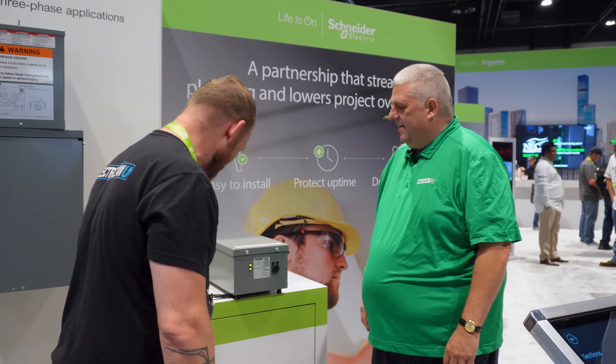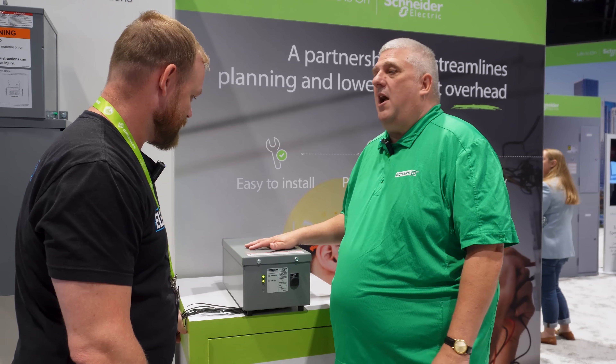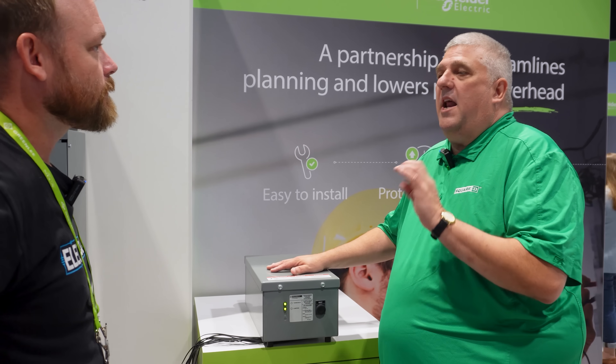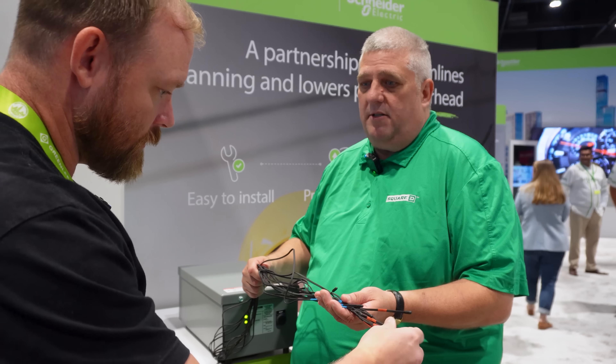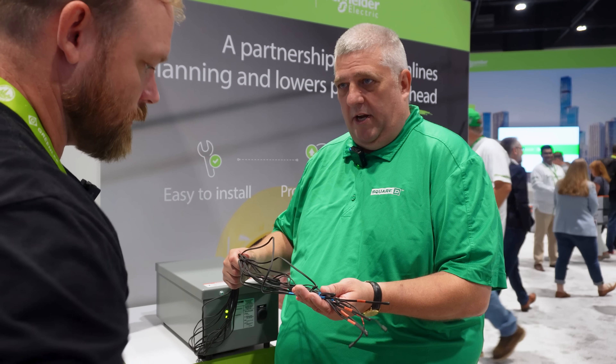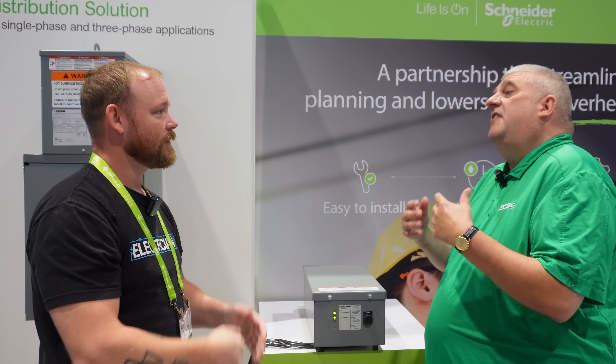What is this with all these crazy sensors and leads? This is a factory option from Schneider Electric — it monitors your connection points inside the transformers. Each of these thermocouples will go to the four secondary connection points and then the six primary connection points. There are three made by the contractor, but we also ship three tap connections, so we monitor those tap connections as well as the three contractor connection points. It's a way to monitor thermal activity at actual terminations inside a transformer — and it continuously monitors.